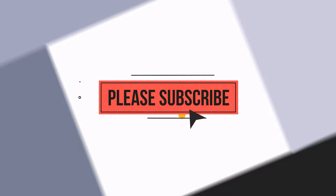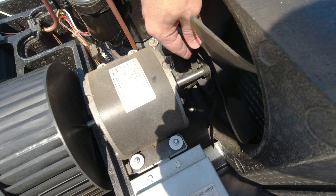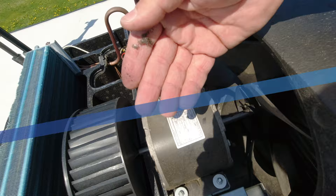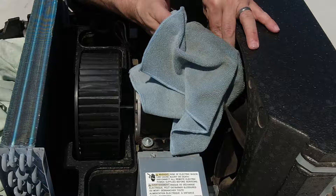There's quite a bit of airflow up here, and depending on where you're camping, this area can get dirty. So after my coils are clean and my fins are straight, I'll spend a few minutes wiping down the components of the AC — spray some water onto a microfiber cloth and wipe down built-up dirt in the drip pan, around the wiring and electrical components. Clean up the blower wheel and the fan blades as well.